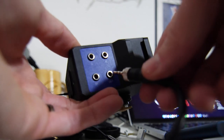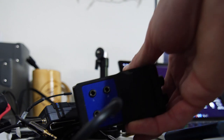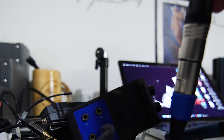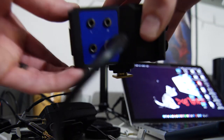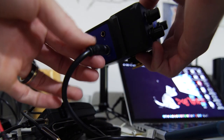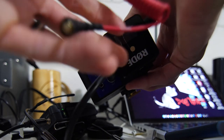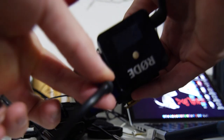I know some people are gonna think that's insane, but it actually sounds really clean. The reasoning behind why it sounds clean is because the mini XLR port is much cleaner than the 3.5mm port on the Blackmagic Pocket 4K — I've done a video in the past demonstrating how much cleaner the audio is into the mini XLR. Now, unfortunately this XLR is an input and not an output, so that's why I have to use the other breakout cable to send an out signal. Then we have our little Rode Wireless Go here — this clips on right here, and I can plug it into the left channel as an in, so now we're going in. This one is out to the camera, and this one is in.